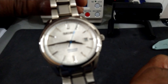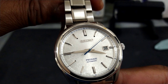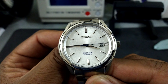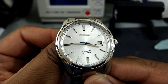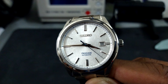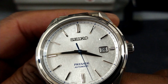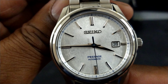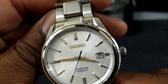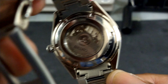Look how beautiful that crystal is — it's a high-definition crystal with an ample amount of anti-reflective coating. Some people mistake this for the Baby Snowflake, but this is a very different watch with a different movement. The 6L beats at 28,800 vibrations per hour, not 21,600. This movement was also leased out from Seiko to Soprod, so it's very similar to the Soprod A10 — but it's really a Seiko-derived movement.